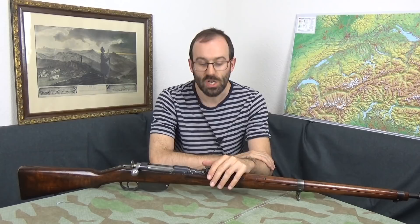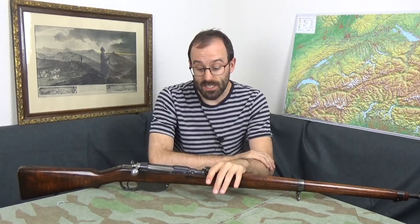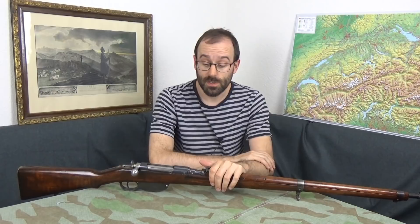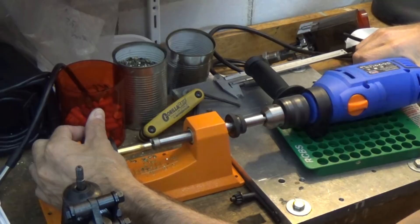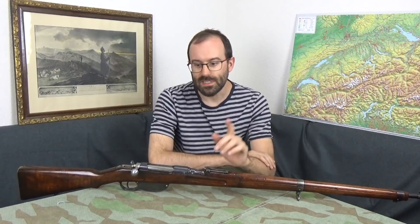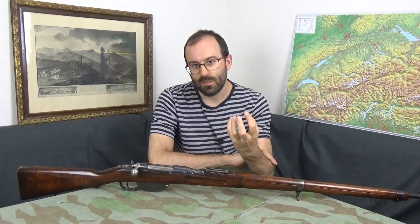It's actually pretty easy as cartridge conversions go. You've got two main choices: you can either take a once-fired 7.62x54R from a Mosin, trim it, run it through a sizer, and then just load and shoot it — that works brilliantly. Or you can take 8x56R, which Privy occasionally loads, at which point you need to size it, trim it, seat it and shoot it. You might have a harder time with that because when you size down you're making the brass around the neck thicker, so you may need to neck-turn or ream it. With the 7.62x54R it's thinner brass anyway, and I've had no issues.